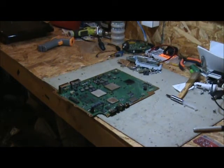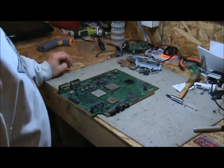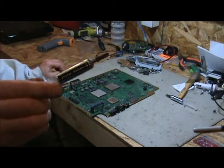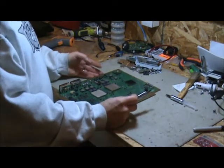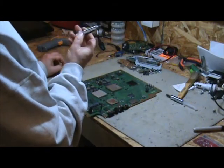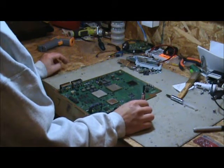It's been over an hour since we started the process. It's back off the board — still at room temperature now, nice and warm. Now we're going to put the sink compound on. What you want to use is Arctic Silver 5. I don't care about the star paste or any other garbage out there — this stuff works the greatest. You can get a 12-gram tube; it's going to cost you close to 20 bucks, around $18 or whatever. Buy it — you can do a bunch of jobs with it.